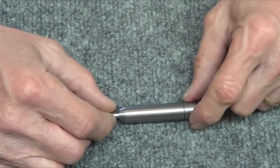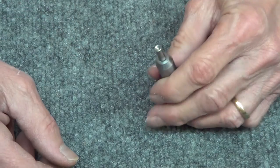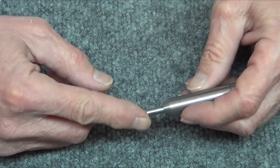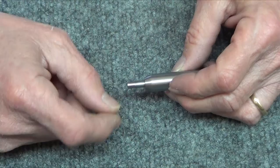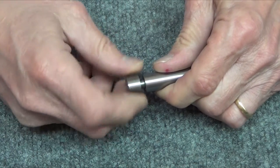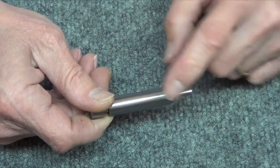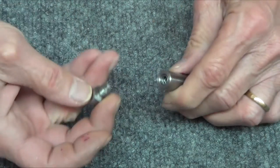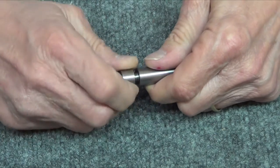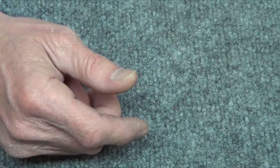One of the other important things was tapping straight. This is spring-loaded and goes in a half-inch collet in the mill. All of the taps have a point on them, so this keeps the tap absolutely straight while I put a crescent wrench on it and run it in. It was pretty easy to make - done on the lathe with the hole centered on the mill. It's stainless and the rest is 1018. You've seen me use this thing over and over in videos. I love it.